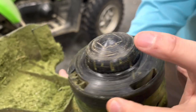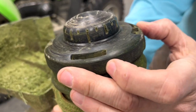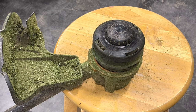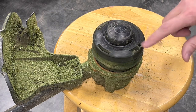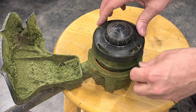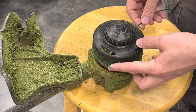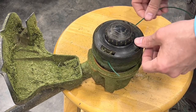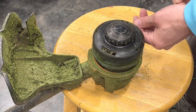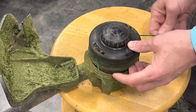If you've worn your string trimmer down like us, there's also a hash mark that is longer than the rest, and that's what you have to line up to load this string. This side's marked 'line in,' so we're just going to slide it right in and the line comes right out the other side. If you try to go the other way, you might be able to get it but it's a little tough. It's pretty quick and easy — just slide the line in where it says 'in' and it pops out on the other side.